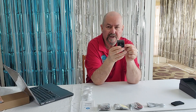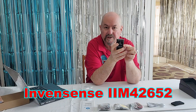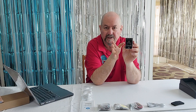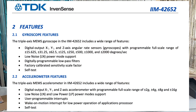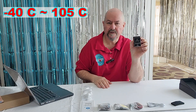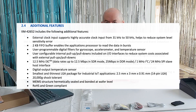It actually has two upgrades. One of the IMUs is the same as the standard edition, but it also has the InvenSense IIM42652, which — if anybody knows about these kinds of sensors — InvenSense is one of the leaders in the industry for industrial automation technology. The IIM42652, in addition to having higher specs, also has a much broader temperature range. It can run from minus 40 degrees Celsius up to plus 105 degrees Celsius, and I've personally flown this in the industrial edition in my binary in 20 below zero and it worked without a problem.